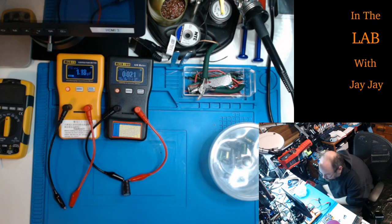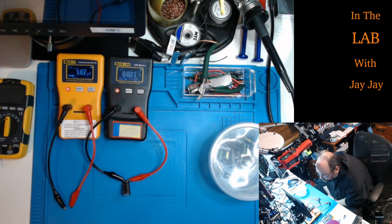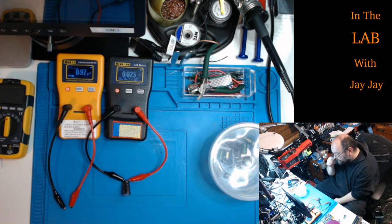They say that for a 10-volt capacitor, which this one is, the worst case ESR is 0.12 for a 1,000 UF. That's actually closer to 4,700, which is 0.23. So this thing is like 1/10 of the worst case, a whole order of magnitude away from the worst case. So I don't think there's any reason to be upset about this one at all. That's quite good. And it is, of course, supposed to be low ESR. So there we go.